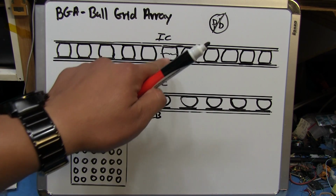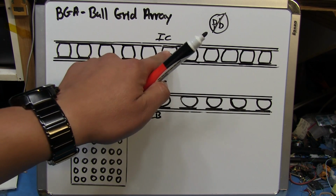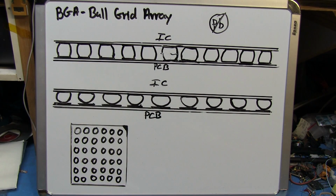What you're hoping for is that maybe the solder will melt a little bit to the point where it makes contact again. Although this technique works, it's usually not permanent, and in the long run, if you continue doing this, you're eventually just going to damage things. In the short term, it might work, and you can get a few weeks out of this. As I explained, the first time I did this, I did it with the heat gun, which is not something I would normally do, but I just didn't have the equipment to deal with this properly then.